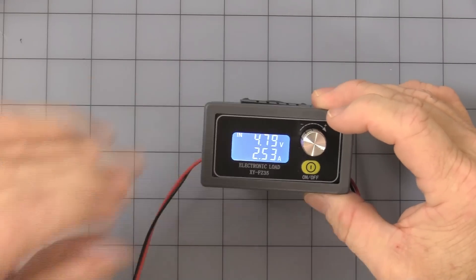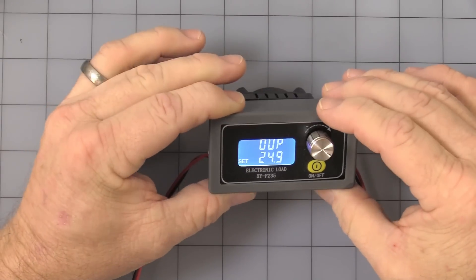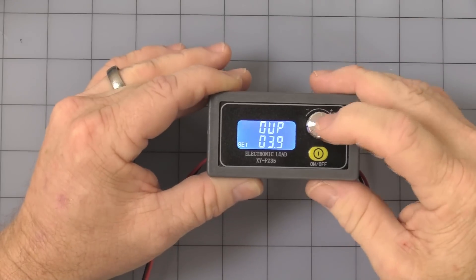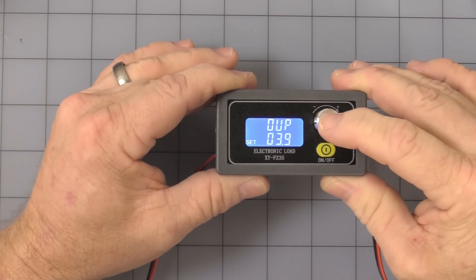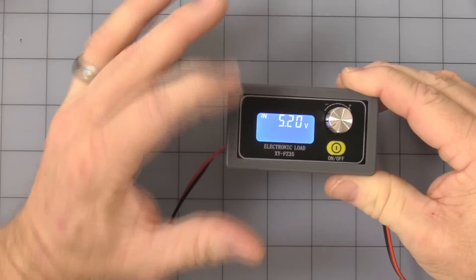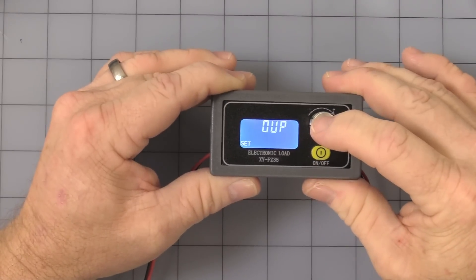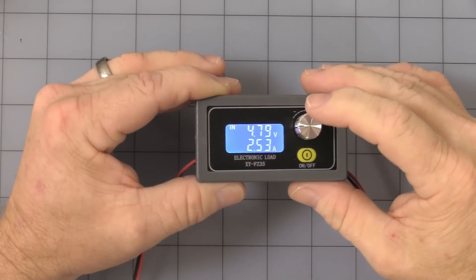Let's get into some of the more advanced settings and safety features. If you press and hold for three seconds, the first thing you see is over-voltage protection — this comes set from the factory at 25.2. To show you what happens, let me turn it down to four volts. As long as it's flashing, it's not in operation. Press and hold for three seconds, and it instantly shuts down because it's over the threshold — it disconnects everything and flashes the over-voltage protection warning. Let's press and hold again, turn that back up to factory setting, press down and it turns back on and is back operating like normal.